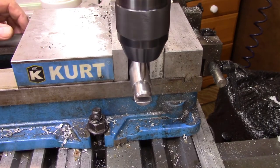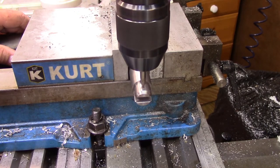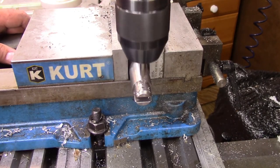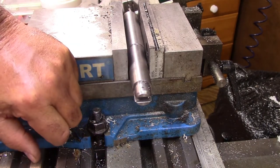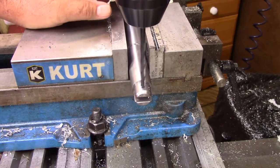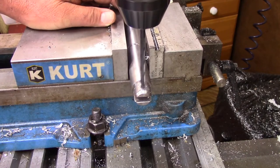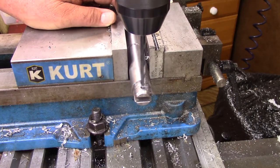Okay, now we've figured all this out. We're going to center drill this thing. I've figured it out, leveled it up, laid it out, squared it up — all the good stuff I need to do here. Now we're going to set up a center drill and drill it. We're going to run this thing at 1/4-28. The main reason we're doing 1/4-28 is I've got 1/4-28 drills and taps handy. That's why I'm using 1/4-28 instead of 1/4-20.